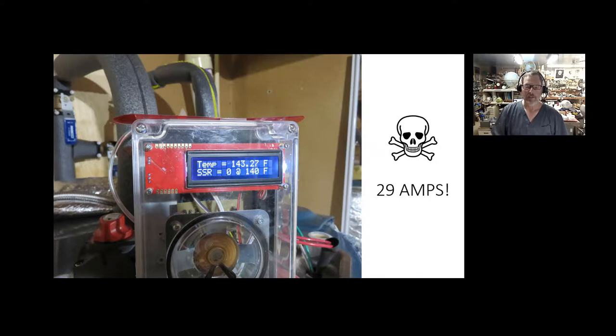This is not my main heater — this is a preheating system I put together. I have an 80 gallon tank, and my photovoltaics heat up this 80 gallon tank partially. I dump my well water into here, it heats up the pre-water, and then it goes to my regular LP gas water heater. My well water temperature is 58 degrees in the summertime, so it was making the hot water heater run a lot more than it should.